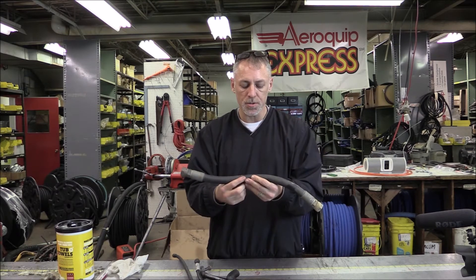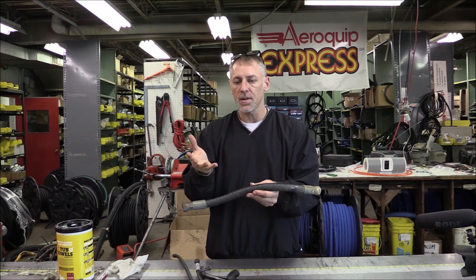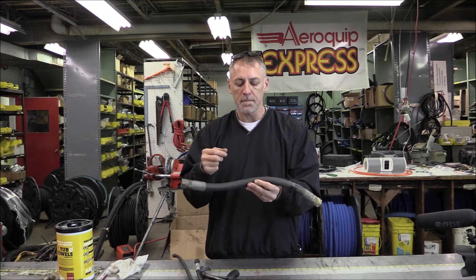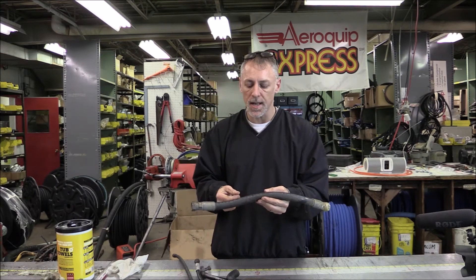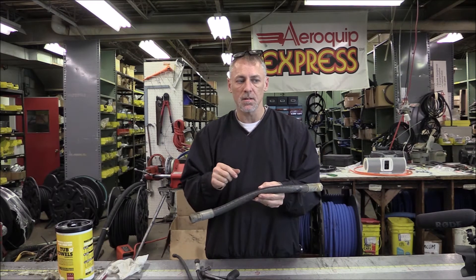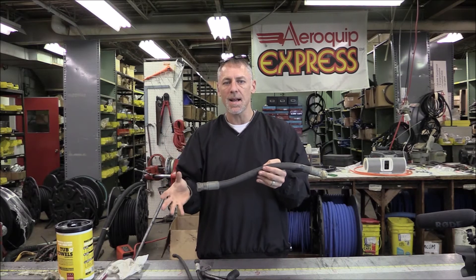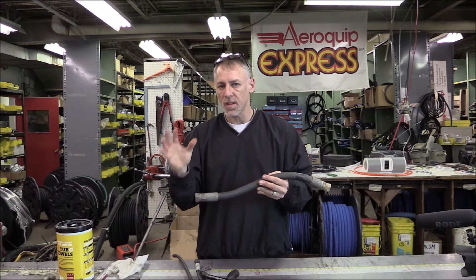It makes your life so much easier. It's a green lay line hose, but if you want to save a little, it's less expensive. If you're a manufacturer building a stump grinder and you only need 3,000 PSI or 1,250 PSI, by all means you can save a couple pennies - they do add up. But I don't agree with manufacturers putting crud hose on their equipment. A quality manufacturer should represent themselves with a quality hose.